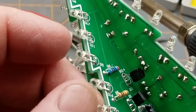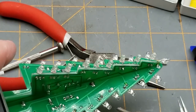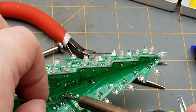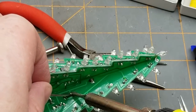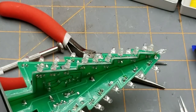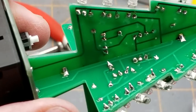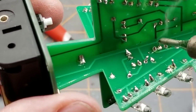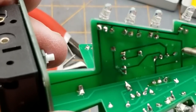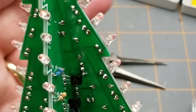It was a bit of a struggle to get it out, but there it is — back in place. Just have to solder it back in and hope I don't break anything else with excess heat. It would suck to lift a pad on this board. But since the board is the fiberglass type — that's better. Does it still work? Yes it does.